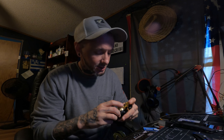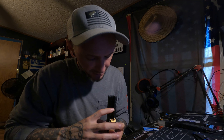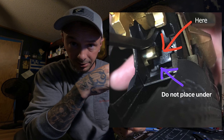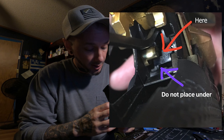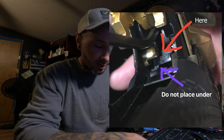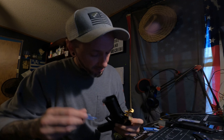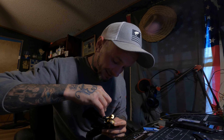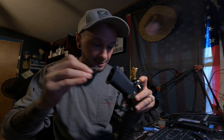Right here it was actually lodged up under the hammer — I'll show a picture of it. If you can see up under that hammer, this center arm needs to go specifically in between — just touching the outside of the hammer. It does not need to go under it; it needs to sit just between and kind of just touching the outside of it.